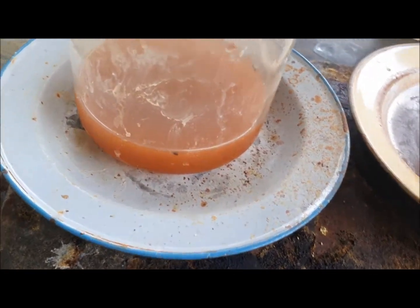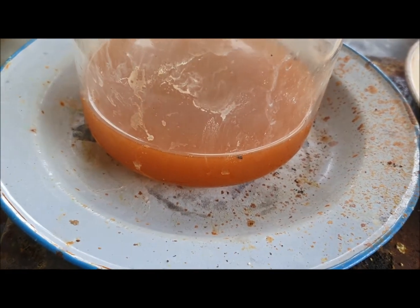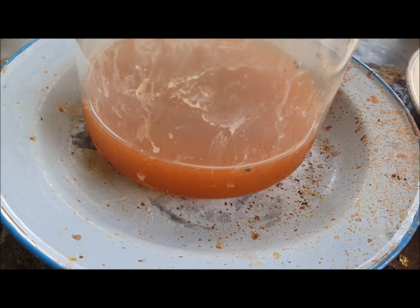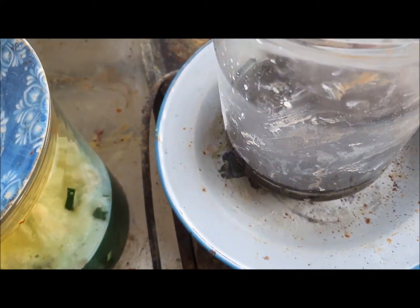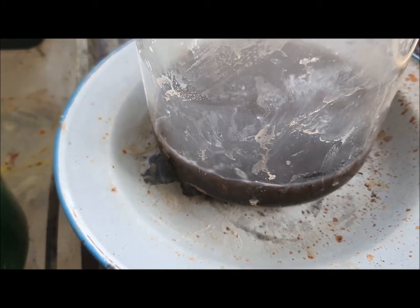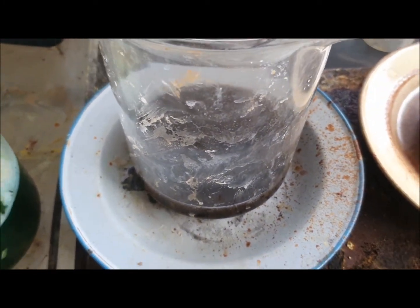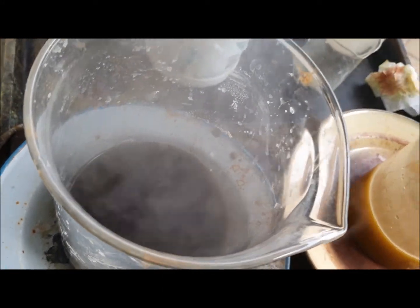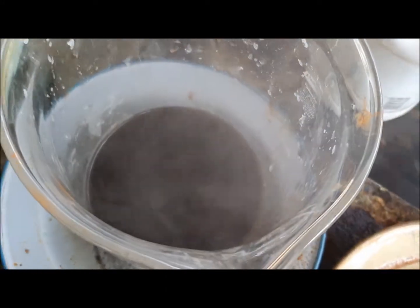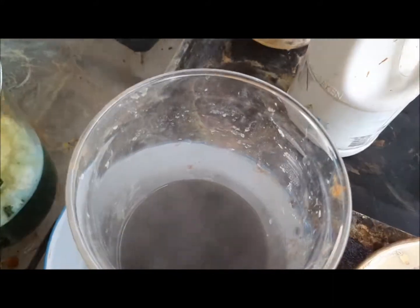It's going rusty again, which confirms there are more base metals — mostly steel — in there, but it's nowhere near as bad as before. It hasn't really heated up yet either, so I'm waiting for it to heat up and get the nitric working. It's been on heat now for four or five hours with no more reaction. I put a little bit more nitric in — nothing happened. So now I'm going to let it cool, filter it, rinse it thoroughly, and then put it in aqua regia to see if there's any gold. I'm skeptical — I don't think there is.